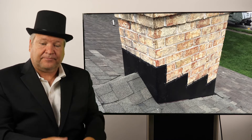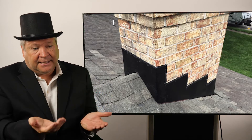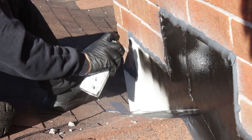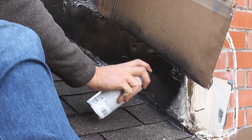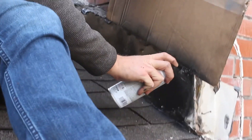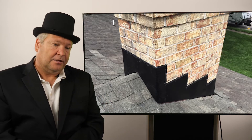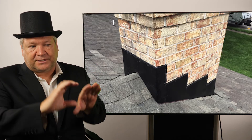In the case of a perpendicular chimney, it'll be like an underlayment that hits the roof and goes up a little bit. They'll also install ice and water shield at these locations — that's another layer of protection from getting water in between the roofing and the chimney. That's your step flashing, or under flashing, and then you've got the counter flashing that goes over top of that.